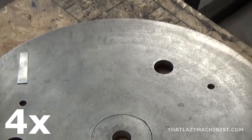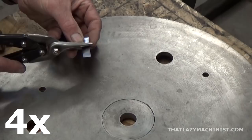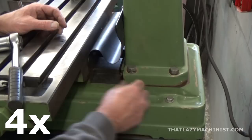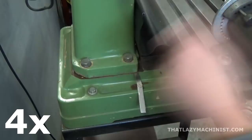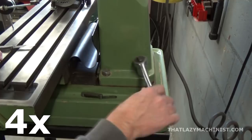I start by snipping the parts I need — this piece becomes two shorter shims. Important: burnish the edges because the tin snips kicked up a burr. Then loosen the screws on one side of the column and insert your permanent shim, after which you can pull the temporary shim out. Start the same operation over again on the other side of the column, snug down that second side — maybe a little more than snug — then come back to the first side and tighten down permanently, then do the same on the second side.